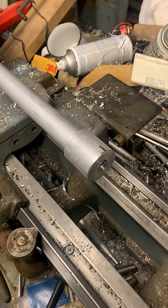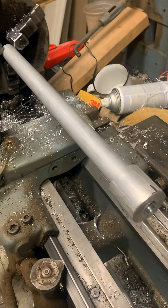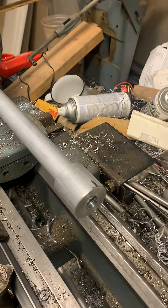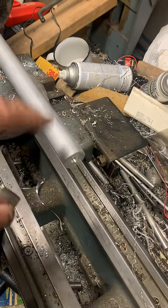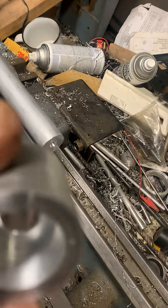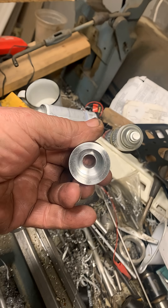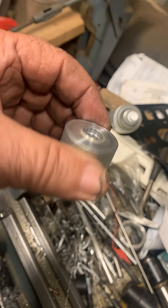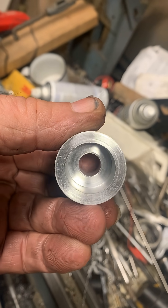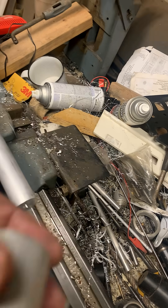And that's my answer to putting a center hole in the end of a rod that won't fit in your lathe. It's simple to make — even if you have a different size rod or a different size center hole, all you have to do is bore this tool to those two sizes for the rod and then the center drill.